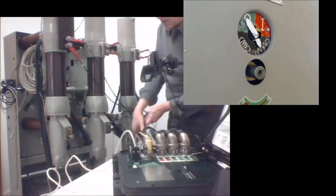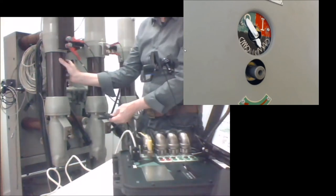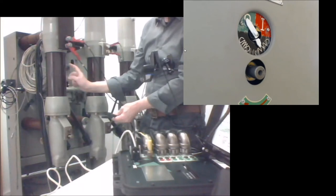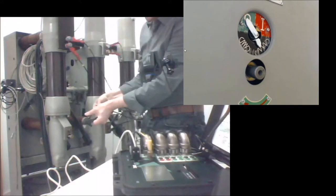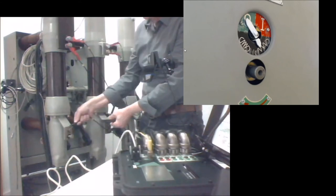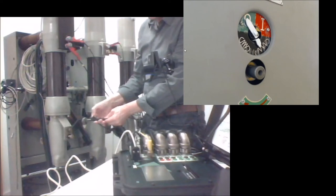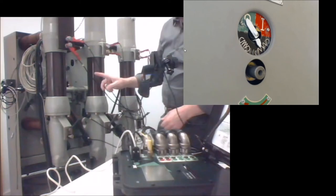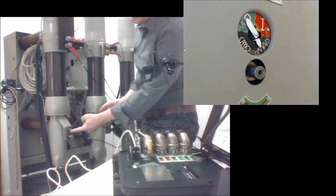the pole. These are the pole, the breaking chamber, and the connection is being opened and closed here inside. So I take the terminal labeled as R for resistance, and place it here, and the terminal labeled as C and place it here. So you see, I have placed the R terminals here and here.